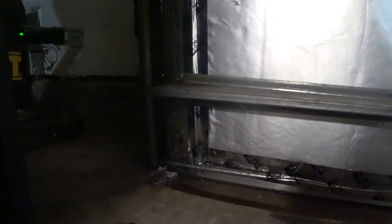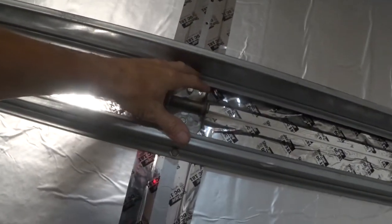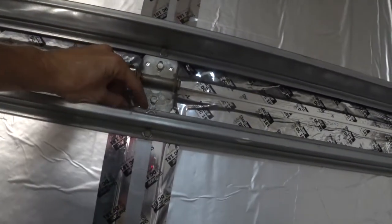Also, be really aware of what you disconnect from the door. If you want to remove some of these screws so that your panels slip in better on the ends, that's great. But be sure that what you disconnect is okay to disconnect. In there, you can see there's a cable. That cable's under spring tension. That cable connects to a bracket down here at the bottom of the door. And if you take that bracket off and you let that cable spring, you're going to have a little bit of trouble getting your door reconnected and working correctly. So be really aware. Obviously I disconnected some of these hinges, but I only ever did one at a time. So this hinge would be disconnected, and that one and that one wouldn't be. It makes a difference. So yeah, be aware about what you can disconnect, when and how.